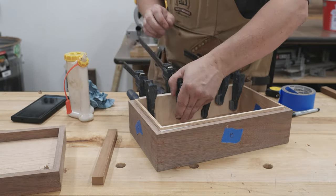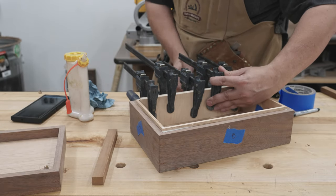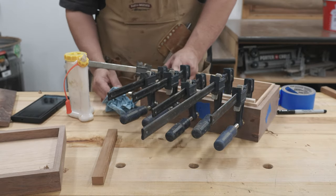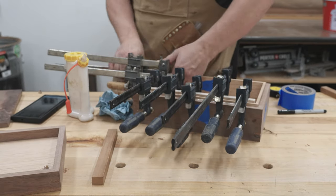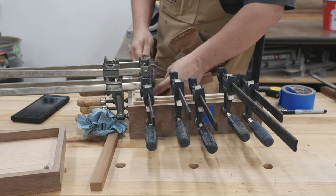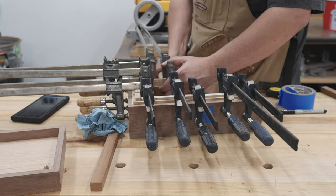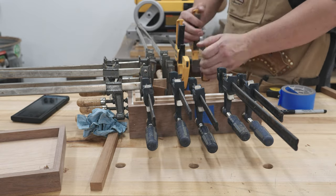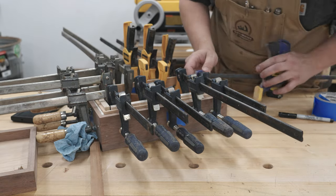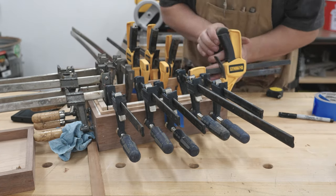I really didn't think about it until I actually had things glued, so I had to rush around and find wood that would work. Just make sure you're more prepared than me and have that ready, and do some dry-run glue ups before you actually put some glue on. You're going to need plenty of clamps — there's quite a bit of surface area to clamp down, and since that Spanish cedar is soft and thin it's flexible, which will allow it to bow in spots. Just make sure you're applying a fair amount of pressure along the whole surface area.